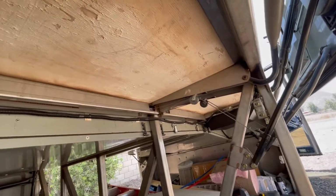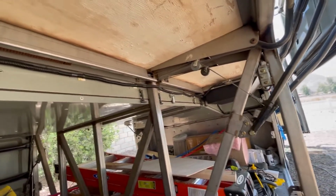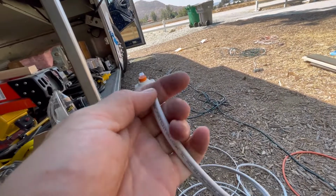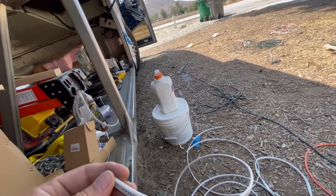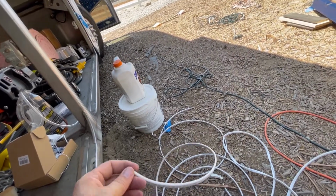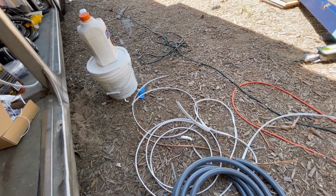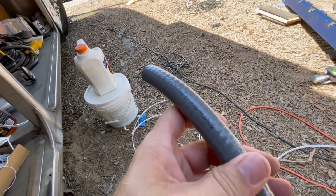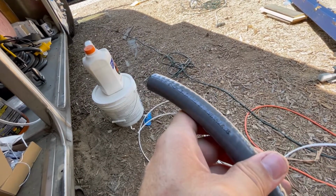You don't want to have, this is my thinking, you know, in automotive and boats and all that, especially in boats, you know, like you're grabbing an anchor, and the last thing you want to do is snag a wire and pull on it and possibly break it. This normal Romex, even the plastic jacket on a marine stranded wire, is not meant to be snagged by metal or pulled on or bent or anything like that. It just doesn't have the protection. I understand why they're doing it. You know, it's in case something were to go wrong, it's easily accessible, etc. But unfortunately, when you are dealing with safety and you're dealing with the possibility of electrocution and the possibility of fire, you have to do things the safe way and the right way.